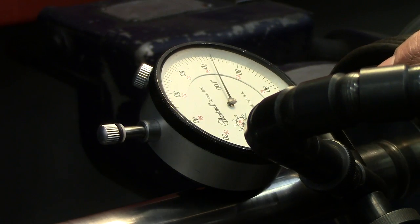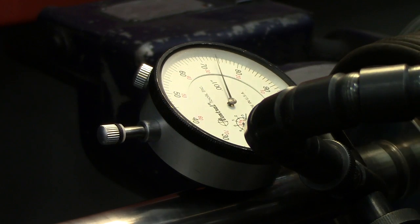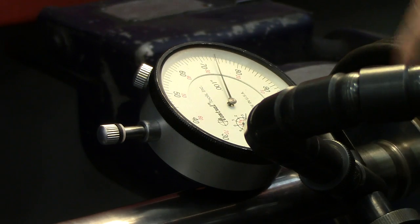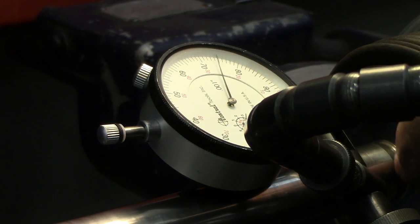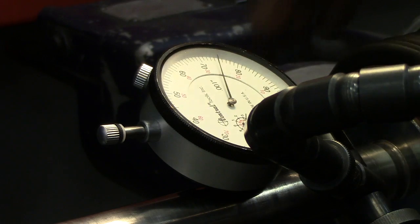Well, of course, half a thousandths here, whenever I could come out, could end up being 3 thousandths of an inch the further in I go on this. So this is important. I'm going to have to clean that up. I'm going to take a whetstone, lightly hit this just to see if there's any dirt or debris from over the years, crud, grease, oils off of our hands alone building up on that could have produced that waver there.